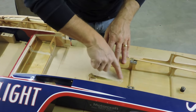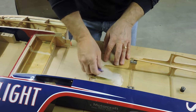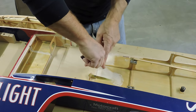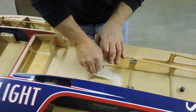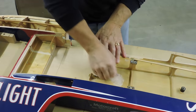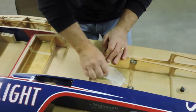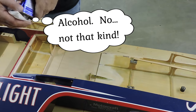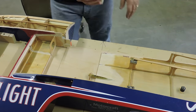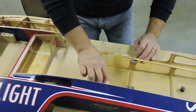I drew a real light pencil line around the piece that we'll be laying in here. My new piece overlaps this just a little bit - I didn't want to just end them right here because then I've still got a weak point where these join together, so it overlaps. Everything gets offset, overlap where I can. Complete waste of time to glue something in that isn't going to hold. I want to get as much of the dust out of there as I can, out of all the dandy little grooves we just made. I want epoxy filling those grooves, not dust.